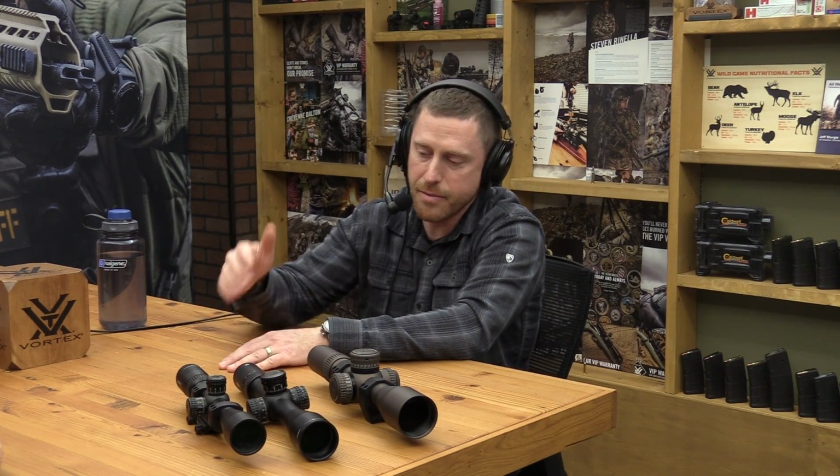It's not really Schott versus Hoya or O'Hara or any of that. In fact, a lot of times when you're making an optical specification, say you have 13 lenses in a scope. You might say this lens is this glass type via the Schott library. Each company gives the same glass a different name, but it's literally the same thing. So you'll say "or equivalent," which means if you go to the O'Hara catalog or the Hoya catalog, you choose the equivalent glass, because it's literally chemistry, a chemical composition. They do make some specialty glasses that only a certain company will make, but you're talking about satellite systems that are millions of dollars, not rifle scopes. There are about three or four big, well-known glass companies: Schott, O'Hara, Hoya, CDGM.